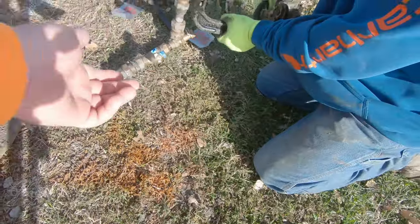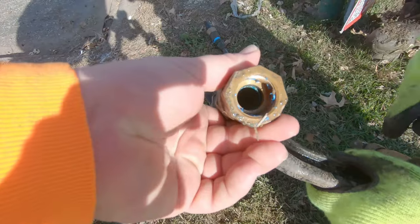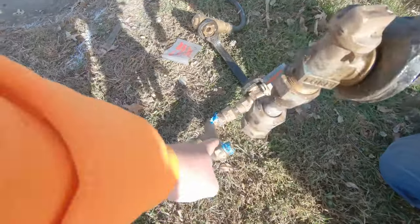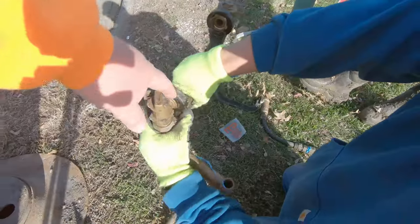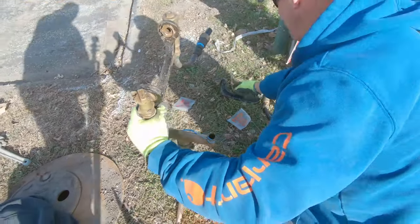That might have been what was leaking. Yeah, it was. You see that. Yeah, see that flat? Not even a gasket in there. No, it's a corp adapter. It's a corp adapter, I know. That's not made to go on pipe thread. Those are two different threads. Stupid dumb heads. It's supposed to look like this. If I can get it to go back to where it was. Yeah, and he's not even having to really wrestle with that because they didn't tighten any of the spanners. Nothing's tight.